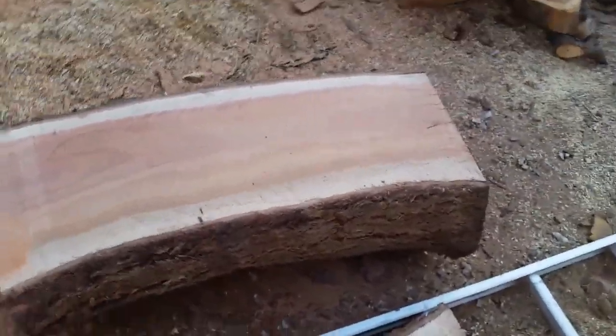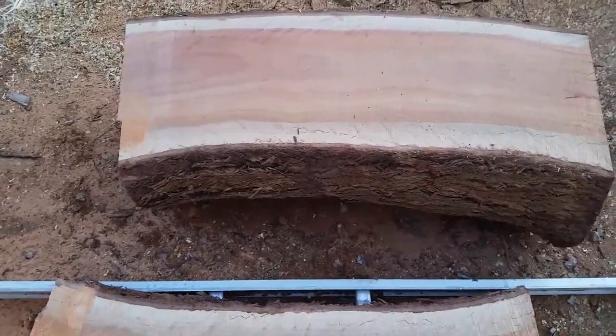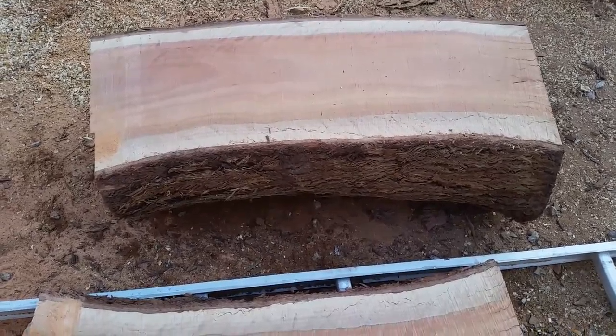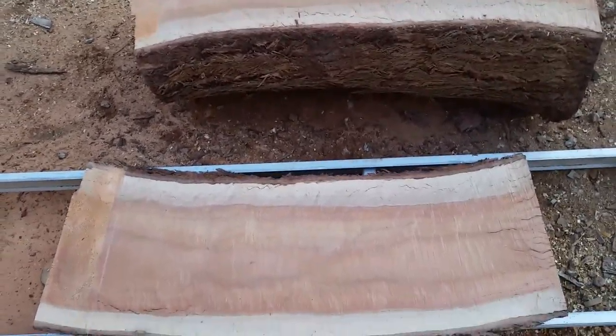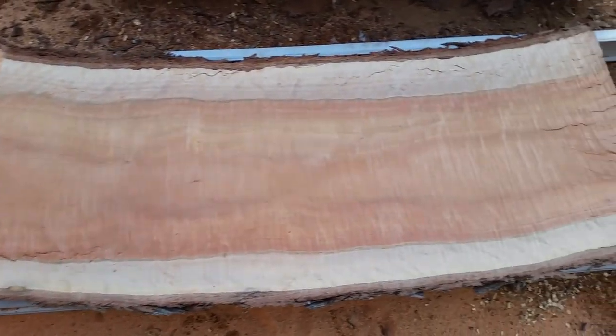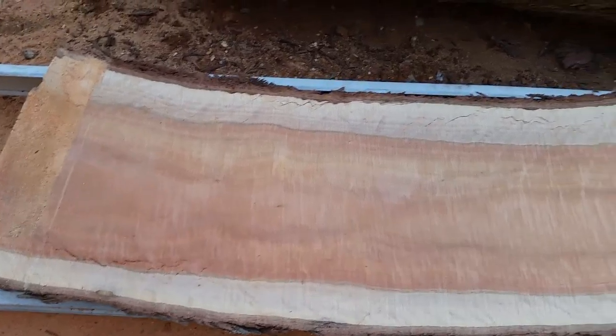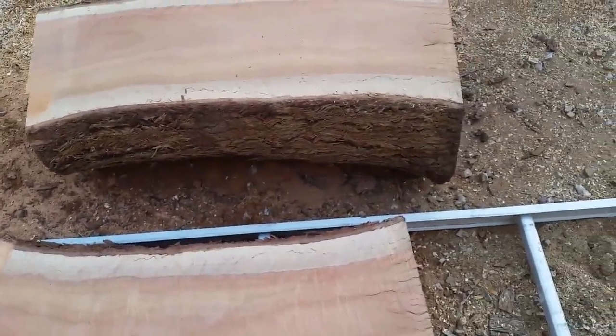I've heard some people say that after you're done, especially milling with the saw for a while, you want to let it idle. My understanding is it cools off the engine. Those high revs thin out the oil, or actually will lean it out. So as it idles, it can get some fresh, cool fuel in there.